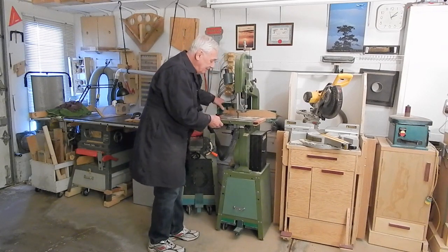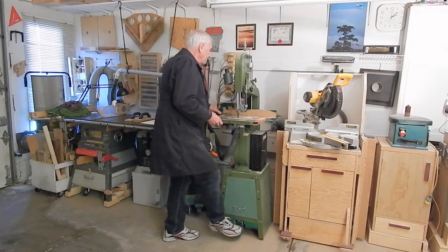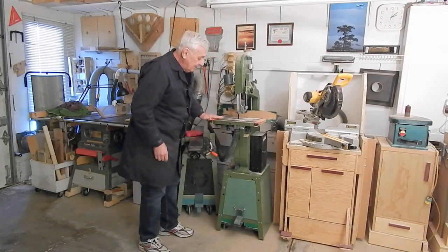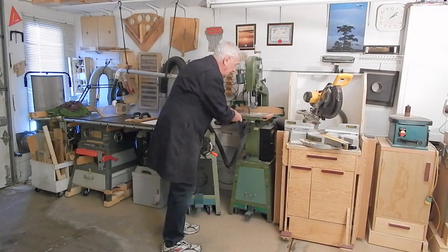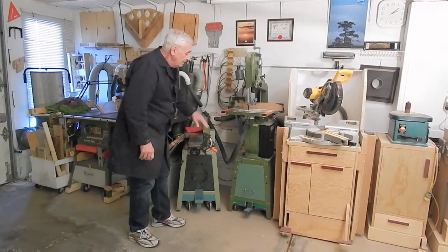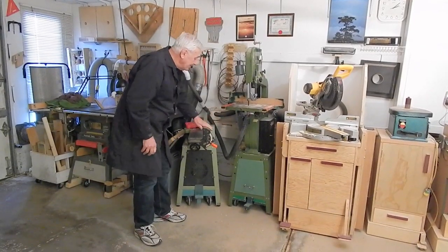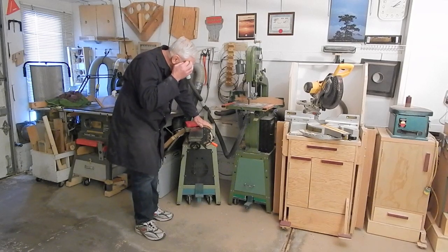So it's become necessary to design a system of quick retracting casters — to roll the tool out, use it, extend the casters, and return it to its parking spot quickly and easily. The casters underneath the jointer and the bandsaw are my first generation of retracting casters. They're the simplest of the designs.